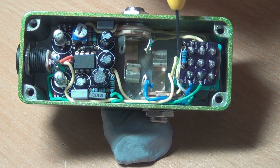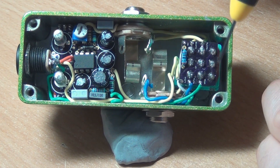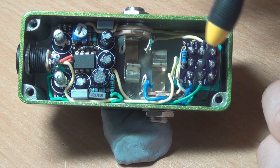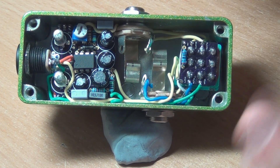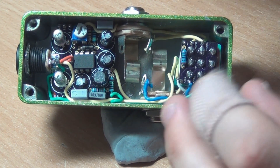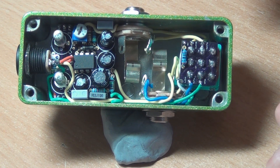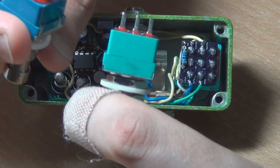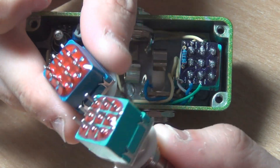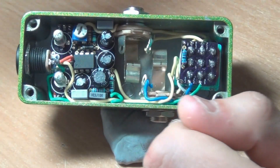You've got the resistor on board which is pretty handy — it's a little bit neater because you don't have to make links between the wires. Once I fix up the issues, which is basically just the board being too tight, it should be good. It actually uses a three pole double throw with the pins on it and not the solder lugs. They've got them on Tayda now so they're easy to get.